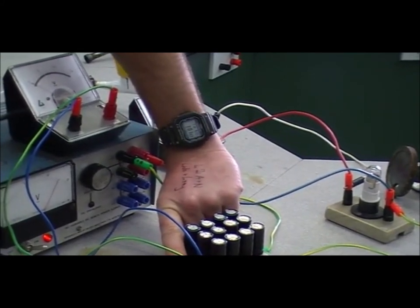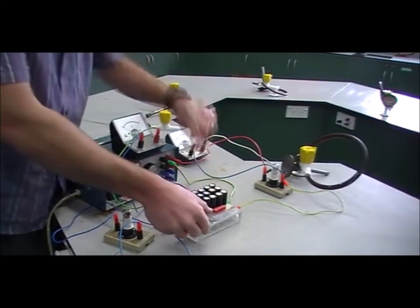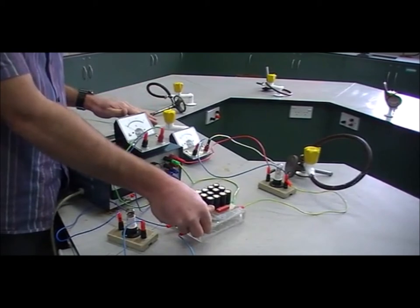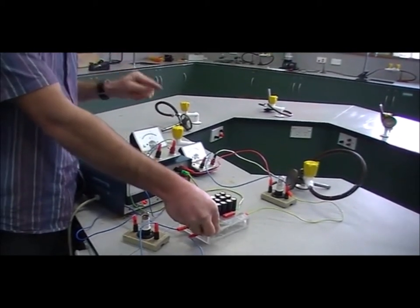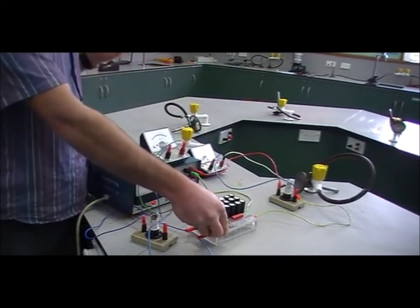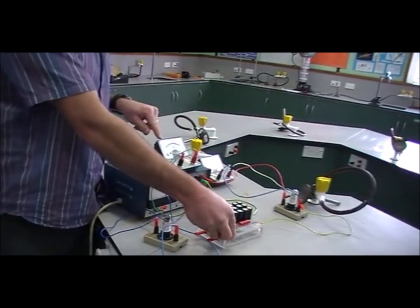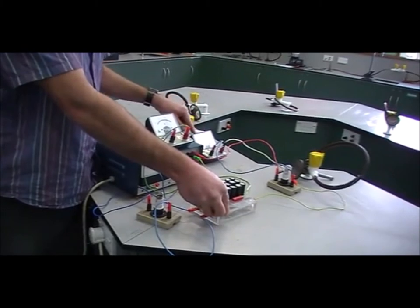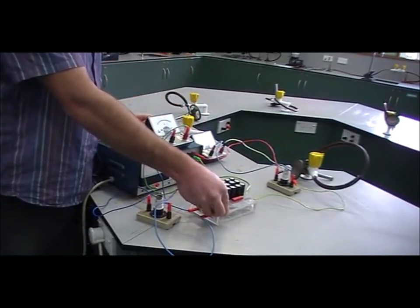What we can see is that at first when we charge it, it goes right from zero up to maximum brightness and then dulls down to zero. When we start to charge the empty capacitors, initially current flows really high — there's no voltage across these at all. But then as this voltage builds up, this voltage here decreases. You can see those two things happening together.